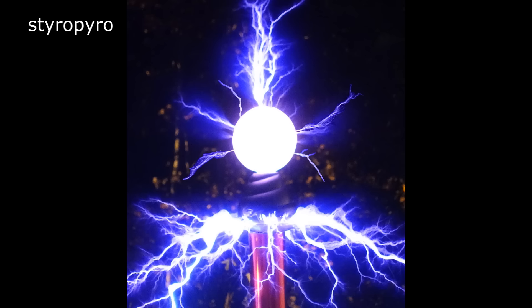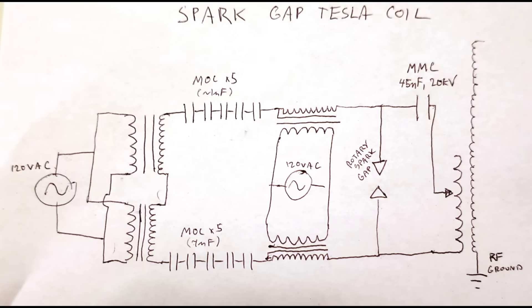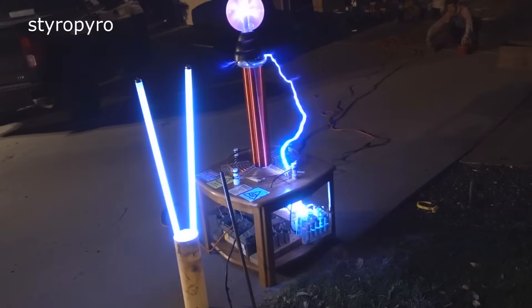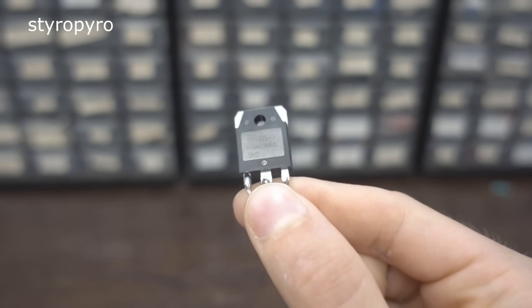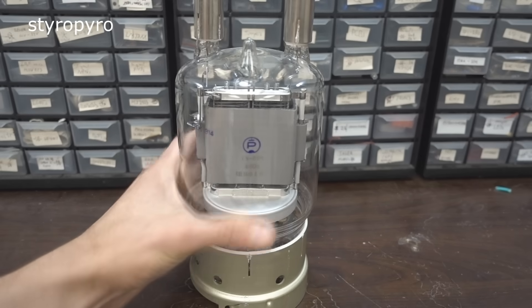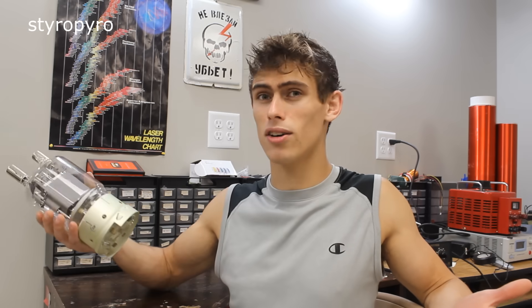This is where Tesla joins the debate, as air core transformers take AC to a whole different level. Not only can they generate gigantic voltages, but the high frequency output should solve this whole impedance issue. So I think I'm going to build a Tesla coil — because let's be honest, Tesla coils are always the solution. Back when I overclocked a plasma globe, I built a spark gap Tesla coil that did the job pretty nicely. This time I want something more portable with more control options. The first thing I have to decide is how I want to switch power to the primary side. Transistor technology has come so far — this little IGBT is capable of delivering 60 amps at 650 volts. I won't be using it though, because Soviet military surplus is way cooler. This right here is the GU-81M generating pentode from the Soviet Union. It's meant for use in big RF amplifiers, but it should make a good active switching element in a Tesla coil.